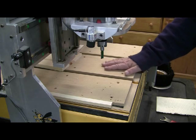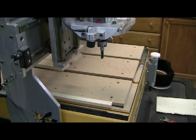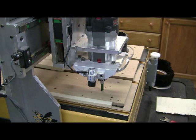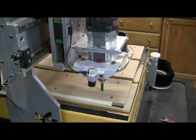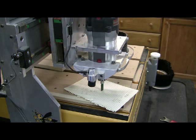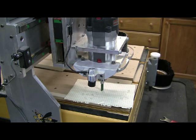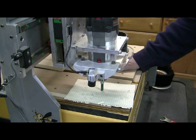So the board is machined — we just machined it. What do we do next? The next step is I'm going to lower the bit to the router table. I already set it up, it's at zero. What I like to do is to place a piece of paper under the bit and lower it down on top of the paper. The paper is about four thousandths thick. Obviously when you machine the spoil board you actually have to touch it, but in this example we have machined the spoil board.